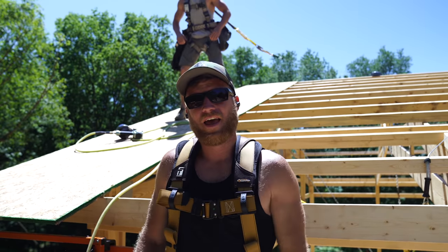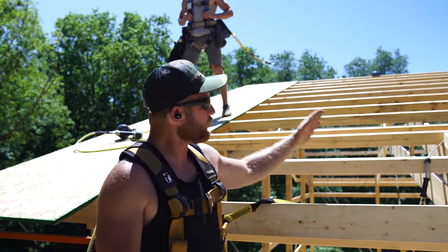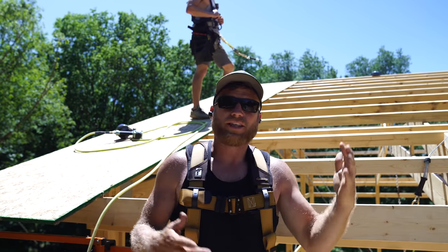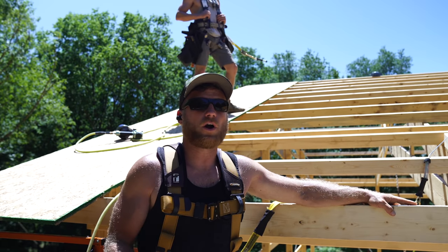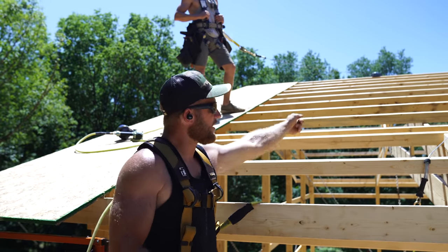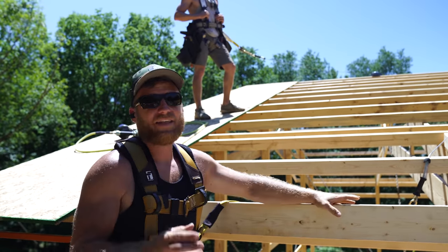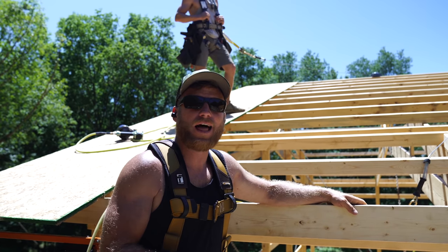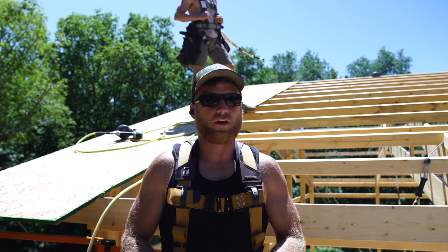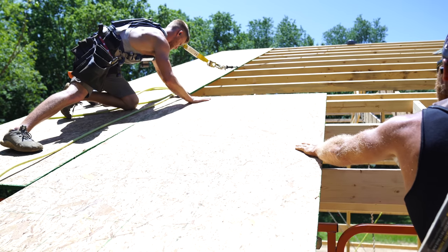This might be a little confusing because it's not typical for your standard stud-frame truss construction two-foot-on-center, where your trusses run one direction. With post frame, our purlins are running horizontal, so we run our sheathing vertical. That also makes it a little harder to get that first row started, because with a traditional two-foot-on-center rafter or truss you'd just measure up four foot, snap a line all the way across, and run your sheathing at that line. We're doing the same thing but on our end wall, which is not perfectly straight since we didn't snap it with a line and cut our tails to perfection. Now that we have a straight line, we can go to town.